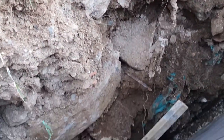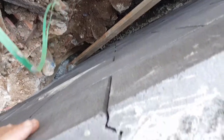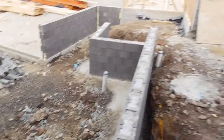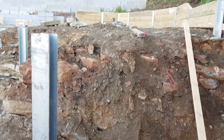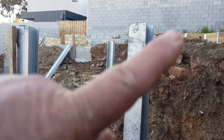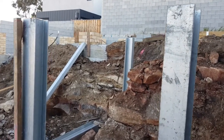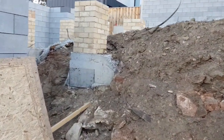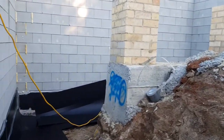Down here it's going to be built with crushed rock and drainage to take all of this weight. If we turn around behind us, we've got the lesser — still structural, but obviously not supporting as much land — so these change back down to the timber sleeper walls. In front of us we've got uprights, some fairly big sleepers, which are retaining over a meter and a half. As we go up into the backyard, they get lesser in height as they're holding less soil back.